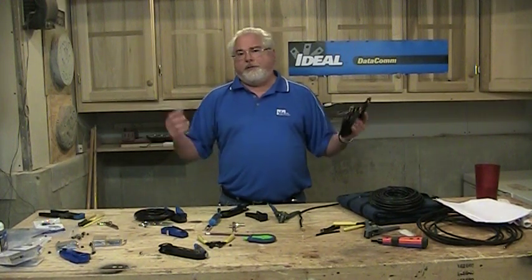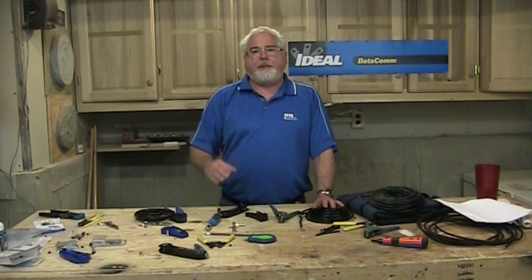That is a critical thing with these wires. If we're going to get the water tightness like in a compression connector that we want, we really need to make sure the cable and connector are matched — that's one of the problems you'll have. Sometimes the connector slides right onto the wire and sometimes you can barely get it on. That is a big pitfall to avoid, and if you take care of that problem up front, your connections will go a lot smoother.